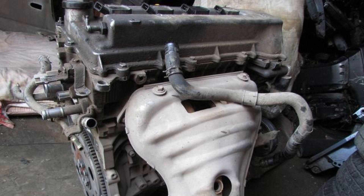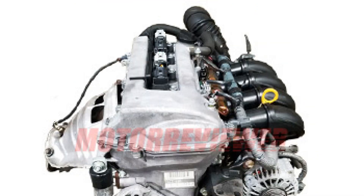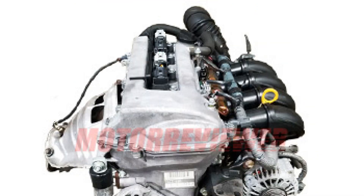As a consequence, due to the lack of pressed seats, the 1ZZ head cannot be repaired. The 1ZZ-FE engine is not regulated by washers; they were replaced by adjusting pushers of different thickness, which greatly complicated the adjustment process. Because of the difficulties in the adjustment and increasing the cost of this procedure, car owners began to refuse such a procedure, which also did not lead to anything good.